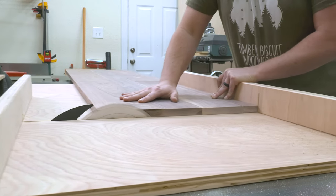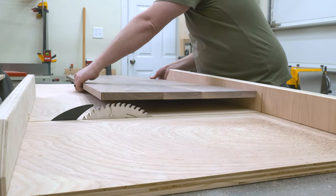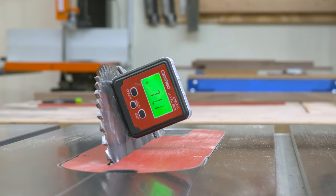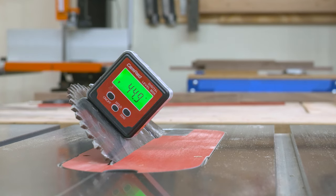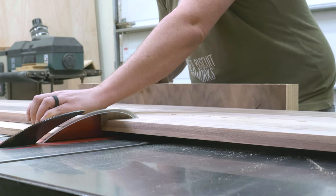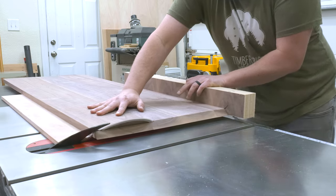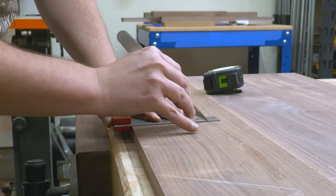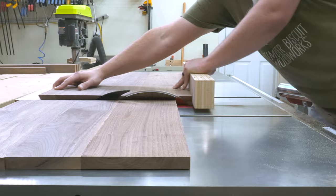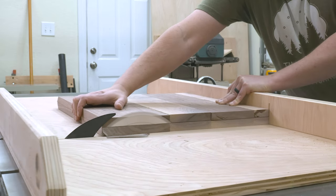Finally it was time to get started on that rounded waterfall edge. Keep in mind that when you make a case like this you're going to end up using more material than you actually need because you have to offset each miter for the waterfall look. I tilted my blade to 44.9 degrees just to make sure that these miter joints are really tight on the outside. The first cut is for the right side of the case, then I flip the panel over and make the next cut for the center, getting as close to my previous cut as possible. Once I marked out the length for the center panel I rotated the workpiece and cut that. The remaining cut is for the left side, which again gets flipped so that the miters match. Then I flush trimmed the bottoms of the panels so they would sit flat.